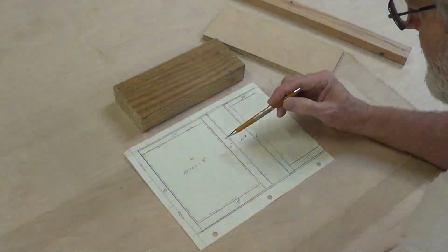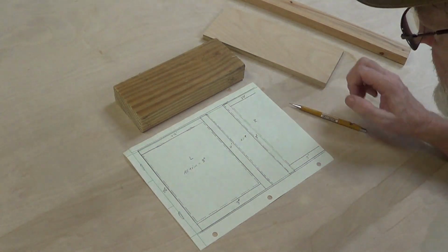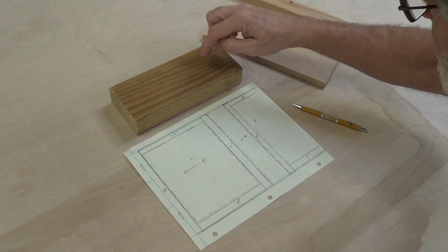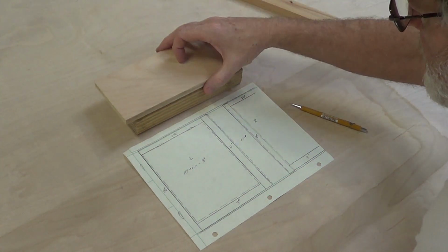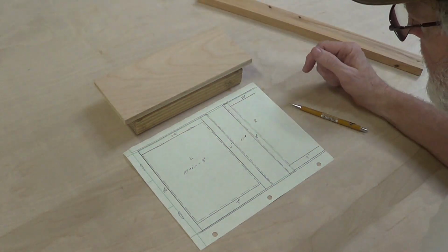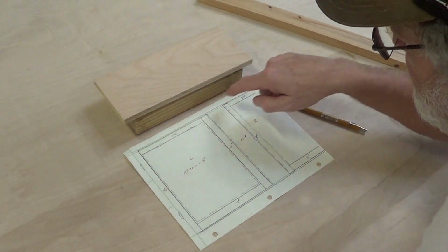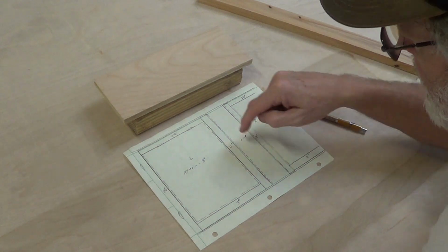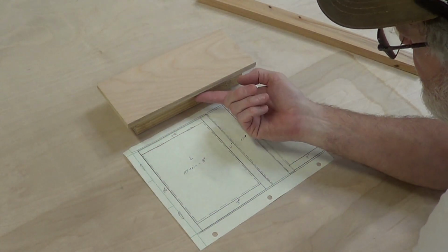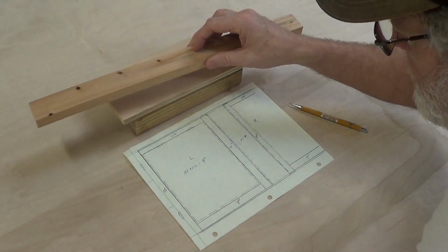This is my design for the double doors. And it's kind of complicated and it looks a little screwed up, but let me see if I can explain why. So we have the same construction that I've been doing for everything. I got my framing, plywood layer, and then trim, right? Now, one thing that complicates this is that I want this framing and the plywood to be flush all the way around here, right? So I don't want this plywood overhanging as a doorstop or set back as a doorstop. So that's kind of the problem.